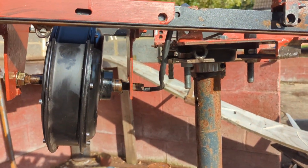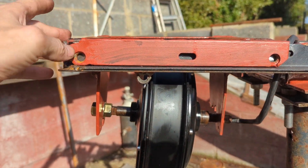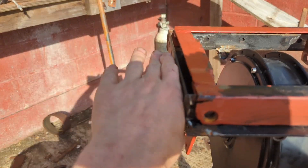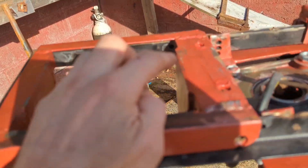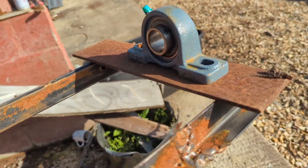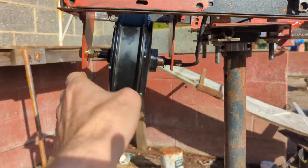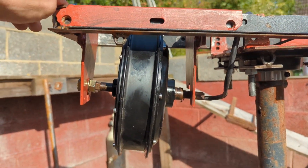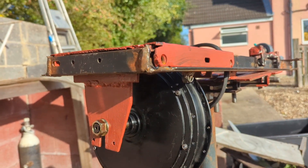Still quite a few things I'm going through in my mind about what to do, but basically the front bearing will have to go here - or maybe I'll even put a plate and have the front bearing coming off here. Then I can have one bearing at the front, one bearing here, and one bearing at the back, and then the chain assembly will be down there. I just wanted to show you where it'll go, and obviously this needs to be parallel to this which it isn't, but it is easily sortable. I'll give you an update when I get any progress.